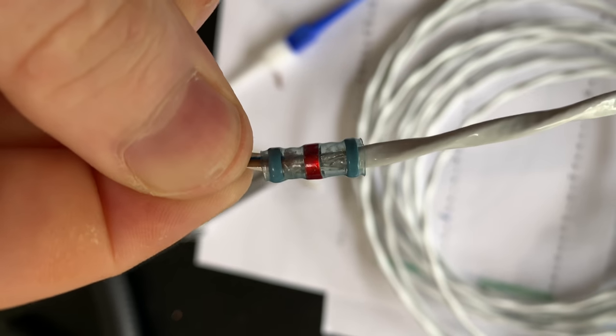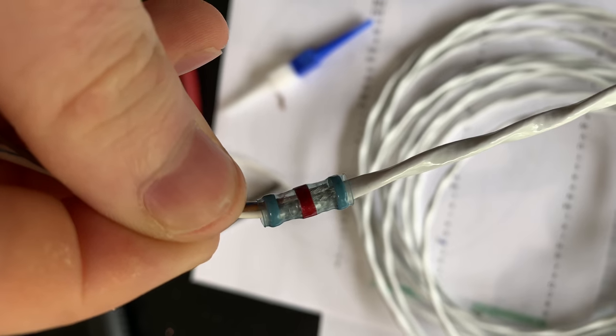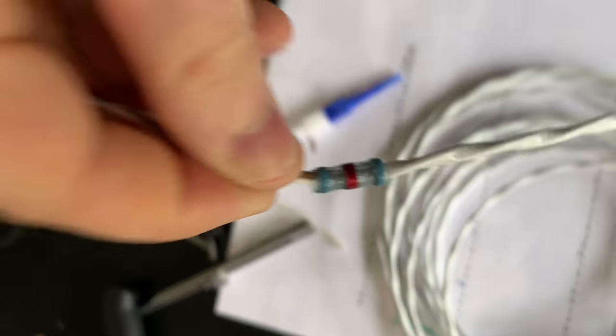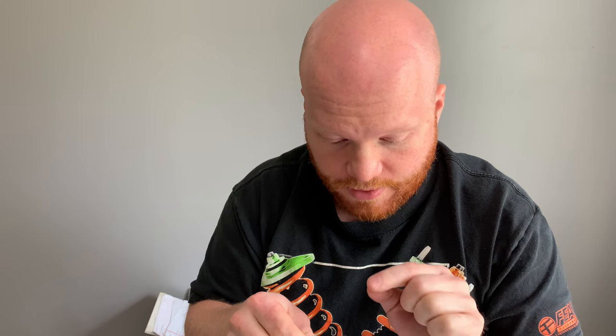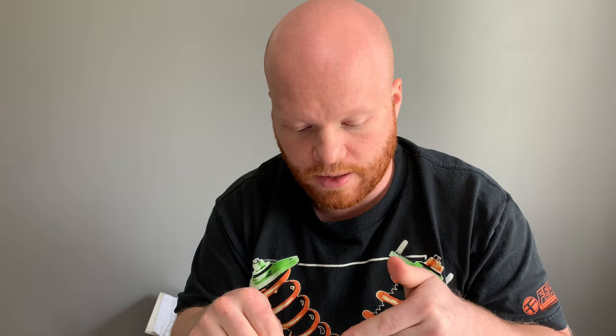And then you're going to have to slide this other wire in underneath the solder. You can see that the braided wire itself right there is inside the sleeve band. And then you heat that up. That solders this brown wire to this sleeving. And then you can use your sensor ground to ground the sleeving. Then you have an official shielded cable.